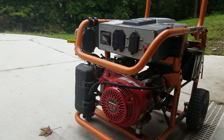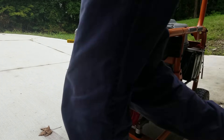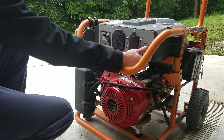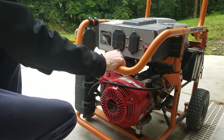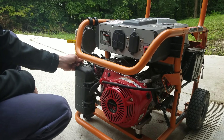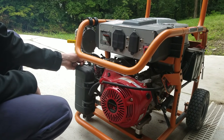What you're looking at here is a 100% cold start on gasoline. You'll see me check the gasoline valve on the generator — any time you run this on natural gas, that gasoline valve is going to be off. As you can see, the engine starts normally as it always does on gasoline. I didn't have any issue.